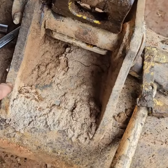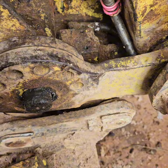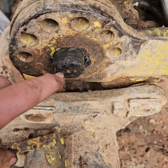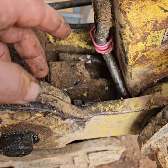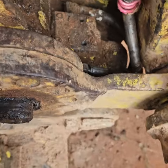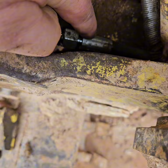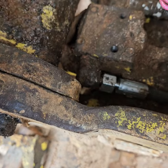I would suggest detaching your bucket with your quick disconnect. Once you do that, when you take this pin out, this arm swings forward and you have plenty of room to get in here with the wrench to unscrew that. Then you can take this part and it rotates all the way around so you can undo the hose over here.